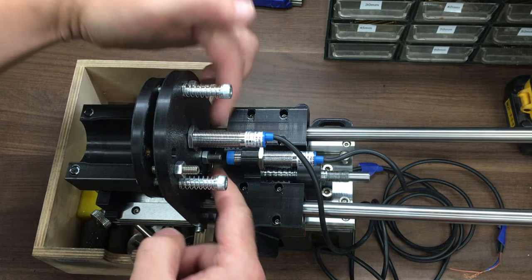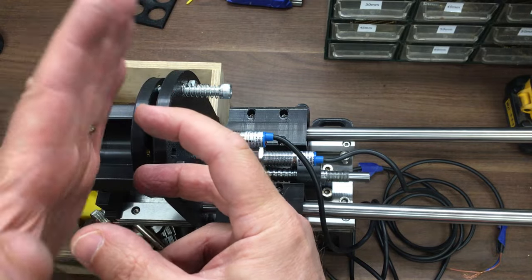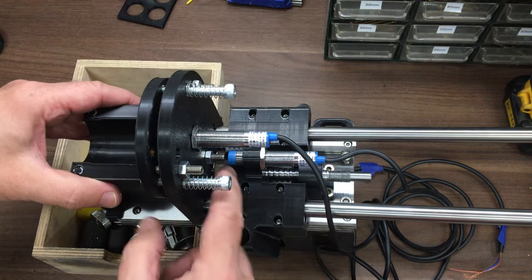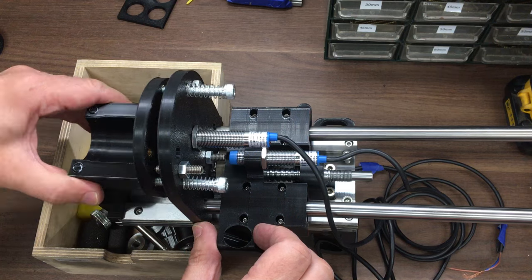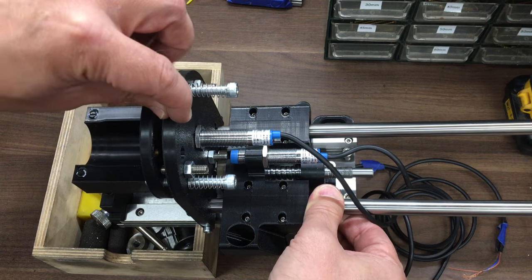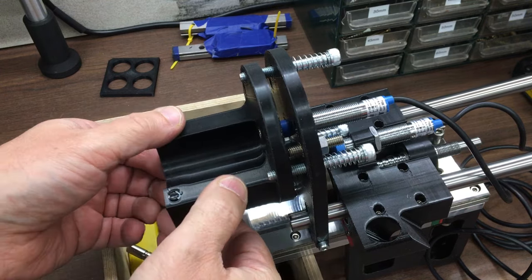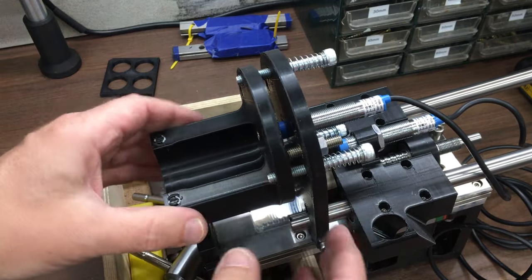Once I've adjusted these three, because these are like 3 pins, I can adjust the pins to get the torch level. Once I'm happy with that, with those 3 grub screws, then that one back there gets used for the touch off detection, so I can adjust that to be in the correct position. And then this one does the collision detection, so how's that? Oh wow, that's not very stiff, but obviously we're going to replace that. But it can't drop the torch, so hopefully that will do it. Anyway, there's plenty of adjustment.